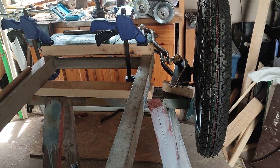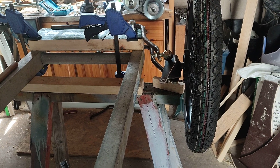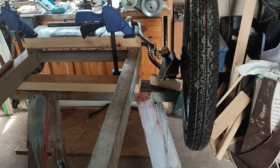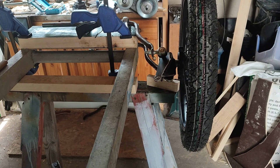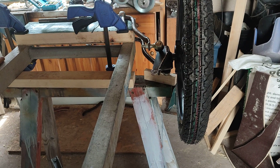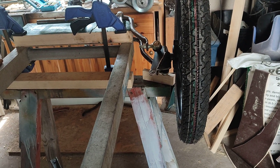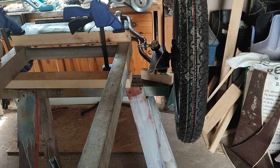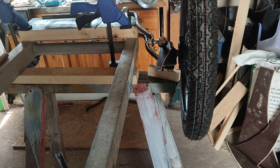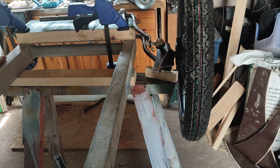Mock-up of Auto Union Porsche-style front suspension using cut-down Miata MX-5 Mark 1 anti-roll bars, tie rod ends, Gemini stub axle hubs, and pit bike wheels.